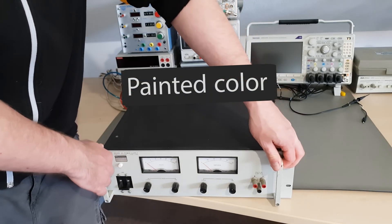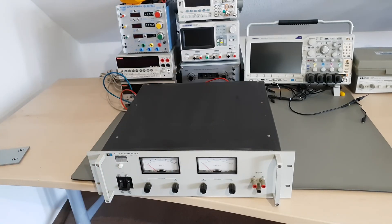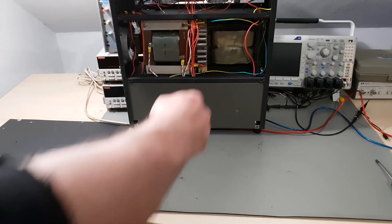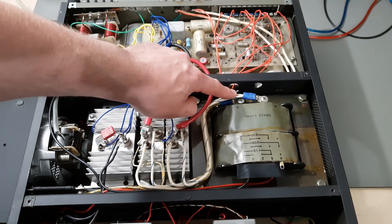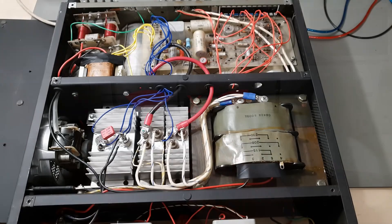This year is its 40th birthday, and I'm not exaggerating when saying that it is still pretty and useful, although maybe a bit overweight. The weight is there for two very good reasons: a huge inductor in series with the output and an even huger mains transformer of course. It has only one output, meaning that in a worst case scenario of say one volt at 40 ampere, the power supply would have to dissipate 20 volt times 40 ampere — 800 watt, holy moly.